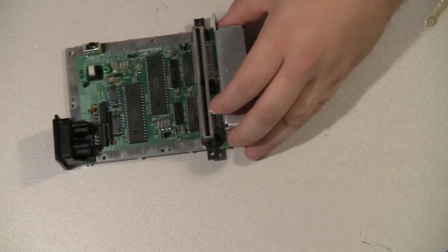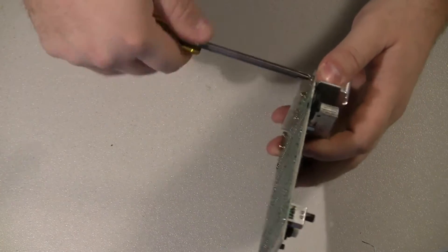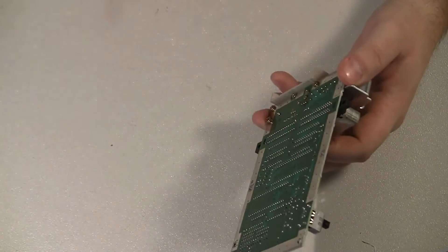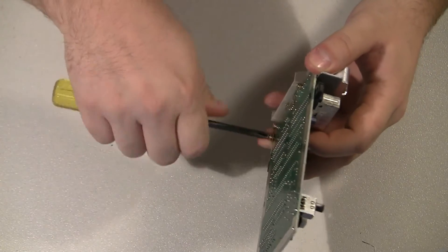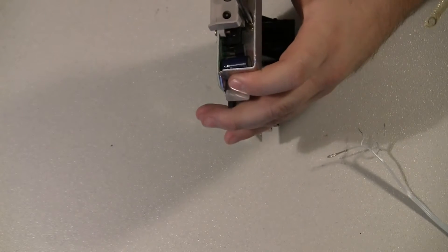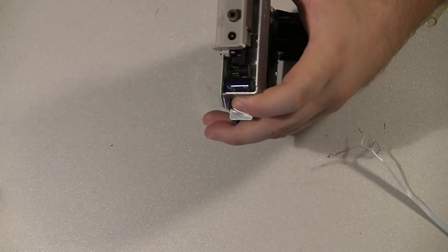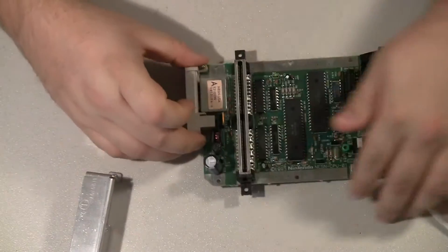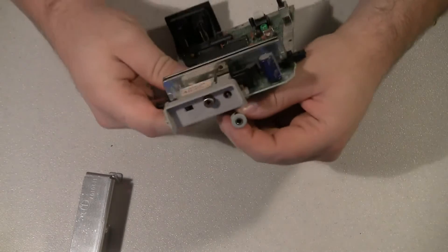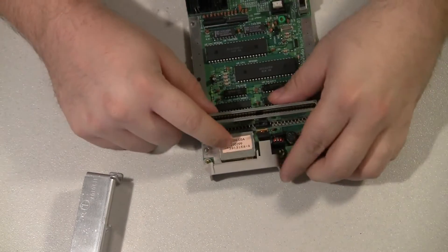What we're going to do is remove the heat sink — two screws on the bottom and one screw on the 7805. The connector is going to go right where the RF RCA jack is, so we need to remove the modulation box.